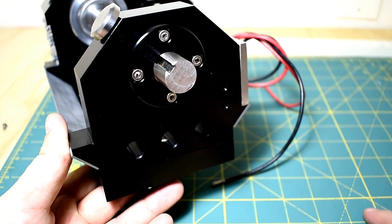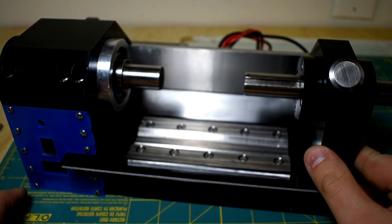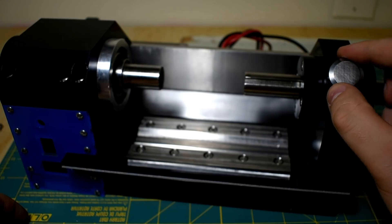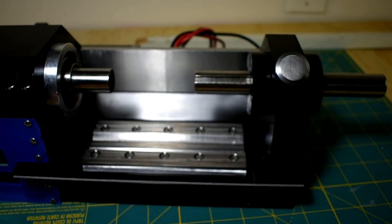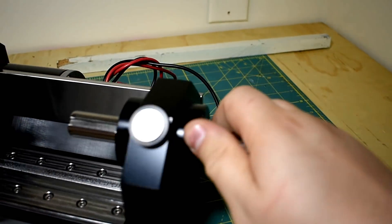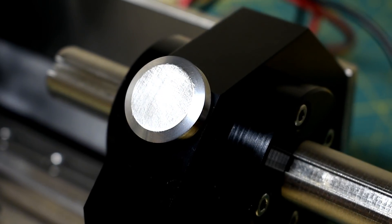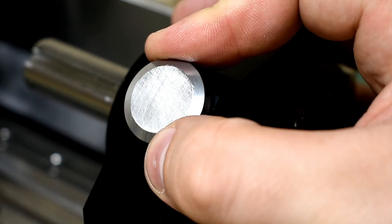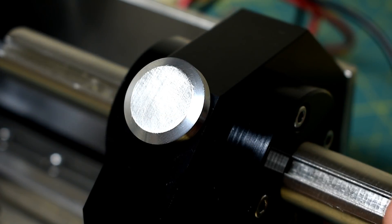These holes actually had another purpose for machining — you'll see that in the next video. This knob I had intended to leave smooth. It's a way of limiting your own fervor for tightening things here — I didn't want to tempt myself to over-tighten and strip something out. Although I do think I am going to either knurl it or put some small lobes on it, just so I can get a little better grip. We'll see how that turns out.